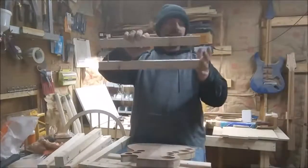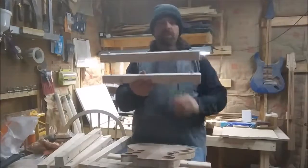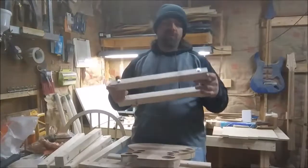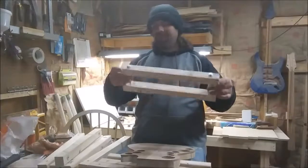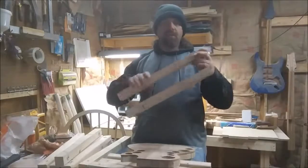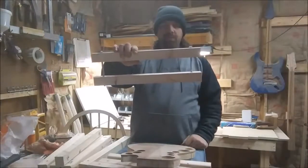Okay guys, so that's gonna do it for this video. Just a quick little clamp that should work. And you can use this for anything that's gonna be wide like that if you wanna do. Now if you're doing the veneer, it probably ain't gonna work. You know, if you're gonna try to glue a veneer on, you probably wanna get a vacuum bag or something like that. But for thicker tops, if you're gonna glue a 1/4 inch top on, or you're gonna glue stuff on in between, you know, this would be pretty cool.